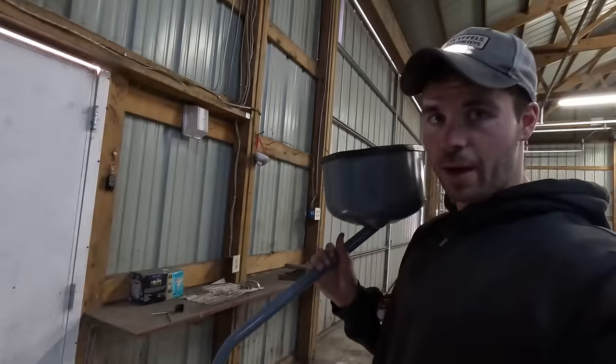We got the mulch finisher unhooked, and now we're gonna go grab a chisel from a neighbor real quick. So we're on the 80 acre farm I bought, and this spot down here is some Okoboji soil. It's really heavy stuff. If you get a big rain, this always ponds out. And so there's some really weird inlet stuff going on here with a 6-inch inlet with this as the top of it. So basically when you got a pond, I bet your corn stalks just covered this thing. This isn't gonna solve our problems, but there's some weird stuff going on. So we're gonna put a proper inlet down here, so that we don't have any issues with dirt going down into the tile system or even just corn stalks covering this little cage that's right at ground level. So we're digging her out, and then we're gonna put a 6-inch.